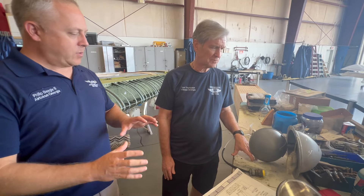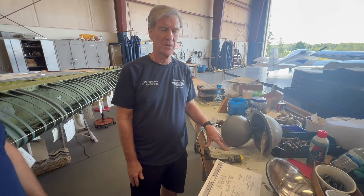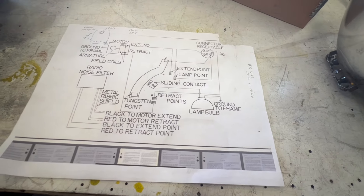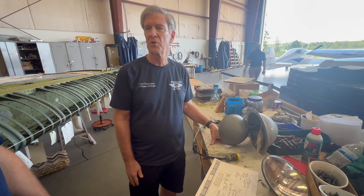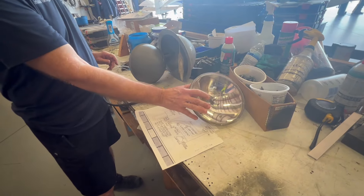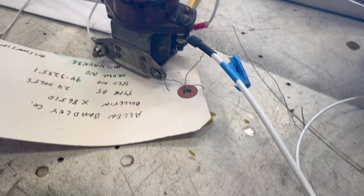So describe the landing light — how did you figure out the wiring? Where did the drawings come from? So we have our subscription to Air Corps Aviation Library, and you can look up all the drawings there. They also coincidentally have the manuals. Grimes was the name of the corporation — they have the Grimes manuals for repair and restoration of landing lights. So all the documentation was there; we just had to follow it. I've been working with another one of our A&Ps, Tony Stein. So yeah — obviously the light is a 600-watt light. This is the original relay that runs the light, and a cannon plug to the light.